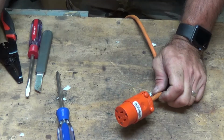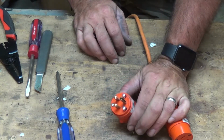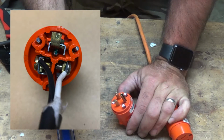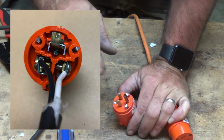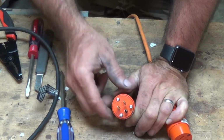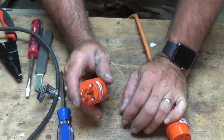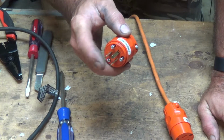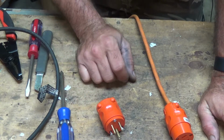This is going to be the exact same process though with the grinder, except for while we're hooking this up, we're not going to hook anything to the ground. Because in this case with the grinder, there are only two prongs, and that's just your hot and your neutral. You don't need one for the ground. This doesn't have a ground, so whenever you're making this connection, just make sure that you plug your wire only to these two prongs. The fact that it actually has a ground there isn't going to matter because it's not going to be connected to anything. Just make sure that your wires inside this, whenever you connect everything, are not touching the ground. That way they will not ground whenever you plug it in. So other than that, we're good to go.